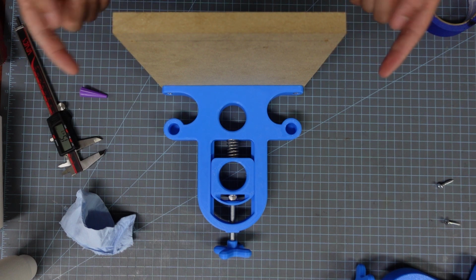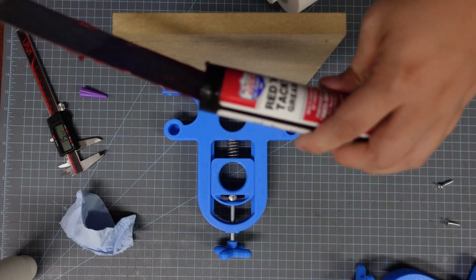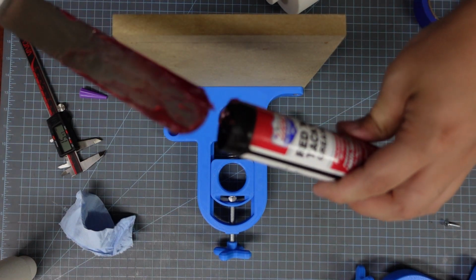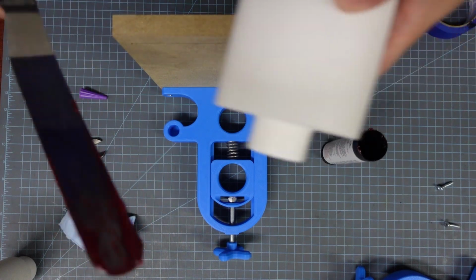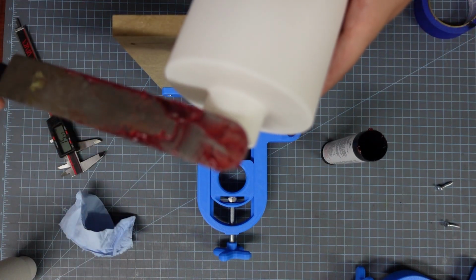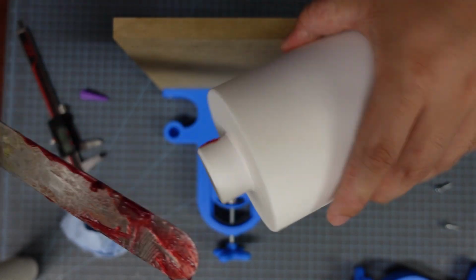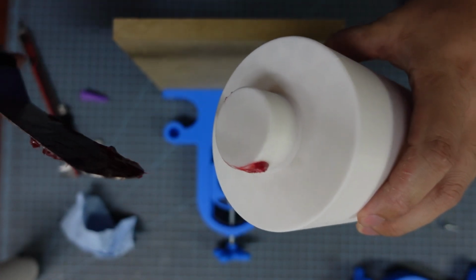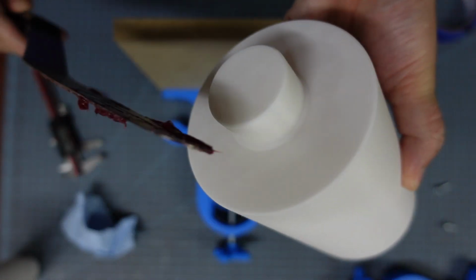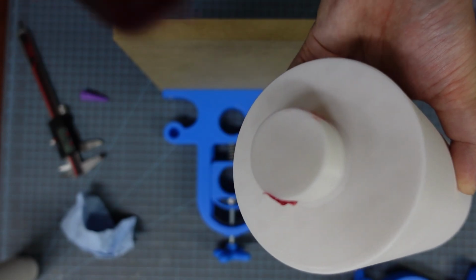And then I'm going to set it on its side with the inside pointing up. And then I want to take some more of my grease, and I'm going to grease these ends of the rollers where they insert into these little bearing holes on the press frame. It's very important to grease these if you're going to print etchings. If you print relief, you probably never hear a squeak out of them, but when you're going through the pressures of etching, it's really important to reduce friction out of the system as best you can.